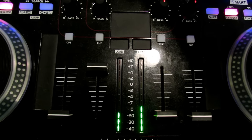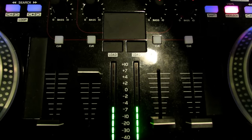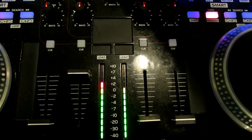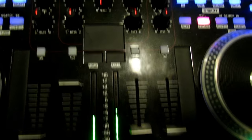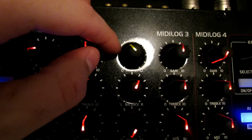You'll see the lights start to blink — you want to get into that yellow range. Just barely tapping into the red occasionally is what you want. Right about there is good; that's normally where I run my mixer. If you have just one set of speakers, take a little sticker or whiteout and put a small mark there so you always know where to set it.